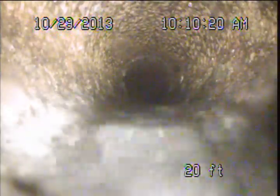But regardless, this is a situation where we're going to recommend a little closer monitoring on this pipe. Some of the later cast irons had a service life as little as 30 to 40 years in some cases. So we really want to monitor it, make sure that it's going to continue to be functional, and that can also help us to catch failures at an early stage and better project the future upgrade date.